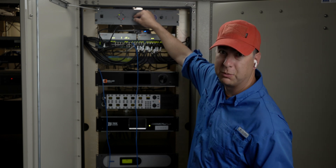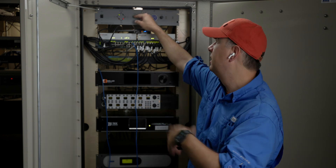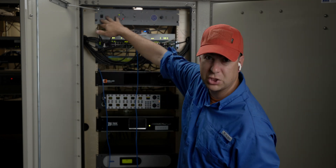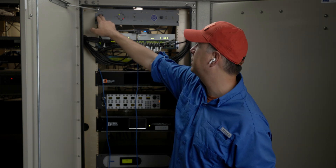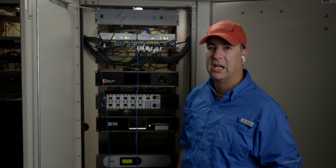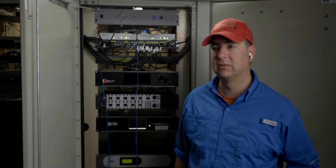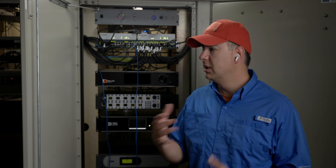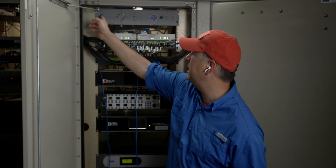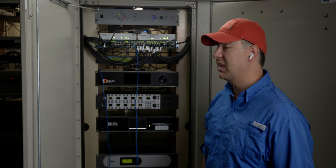Right now I'm in local mode. If I flip to remote, and short certain cables together, it would command the switch to do its thing. On local, it ignores that remote input. I do have a switch on the front here — if I switch it from A to B, you'll see it turns red, and then the other turns green. On the coax switch itself, there's a little knob on top that turns. It takes about three seconds to make that switch. Flip it back to A — it goes red and then back to green. And that's the coax switch.